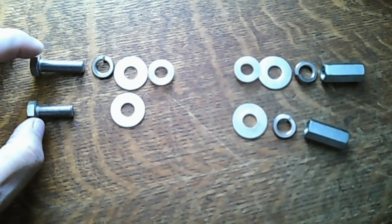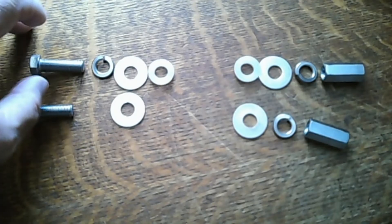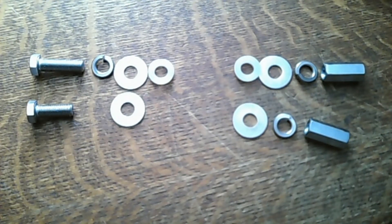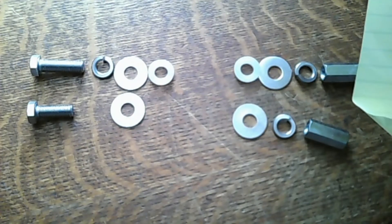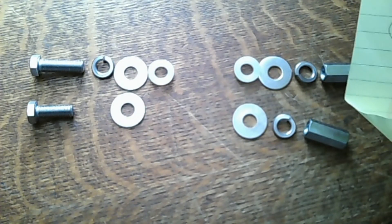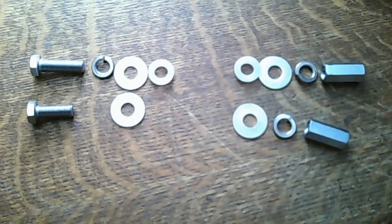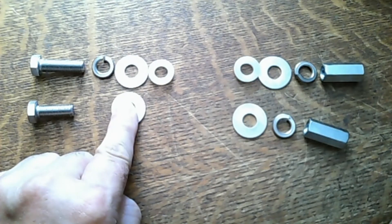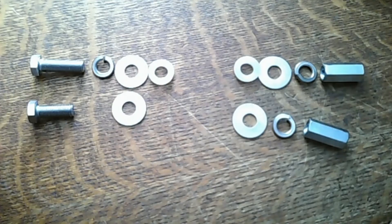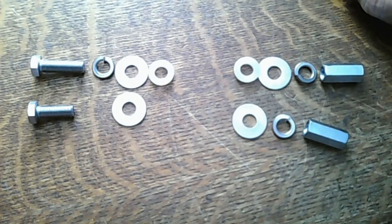I left out one component: on each of the bolts on the driven side, you need a connector to connect the wiring up. What I use are ring connectors — 12-10 AWG wire gauge, three-eighths inch hole connectors. I got them from a specialty shop called Cables and Connectors, kind of like a local Radio Shack. The reason I used round ones was so that they would lay flat against the washers — I thought an actual round connector would give a better connection.